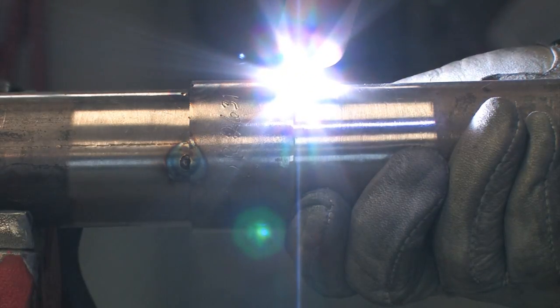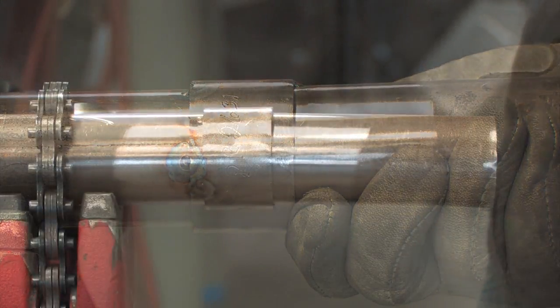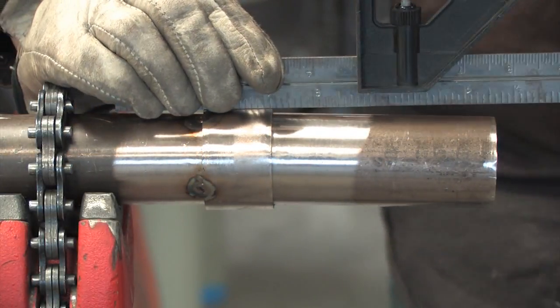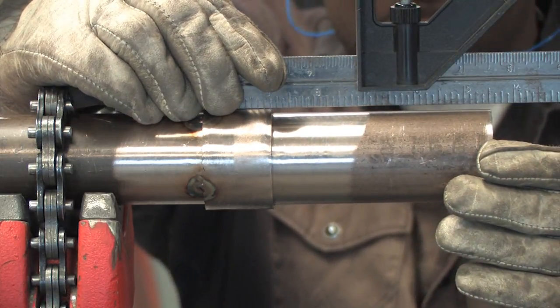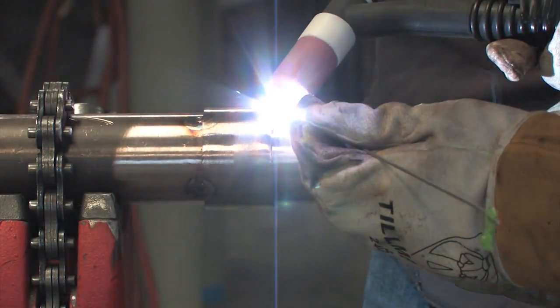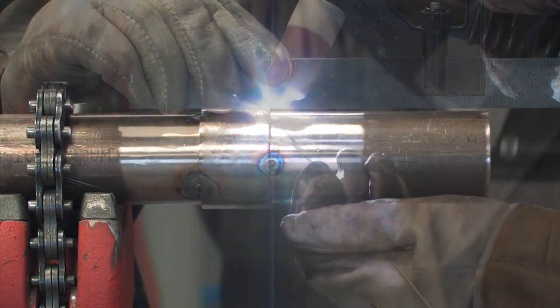All joints below 6 inch have a maximum diametrical clearance of 65 thousandths of an inch. Joints above 6 inch have a maximum diametrical clearance of 90 thousandths of an inch with a 65 thousandths maximum radial clearance. All systems require 1 half inch scribe mark on the fitting.